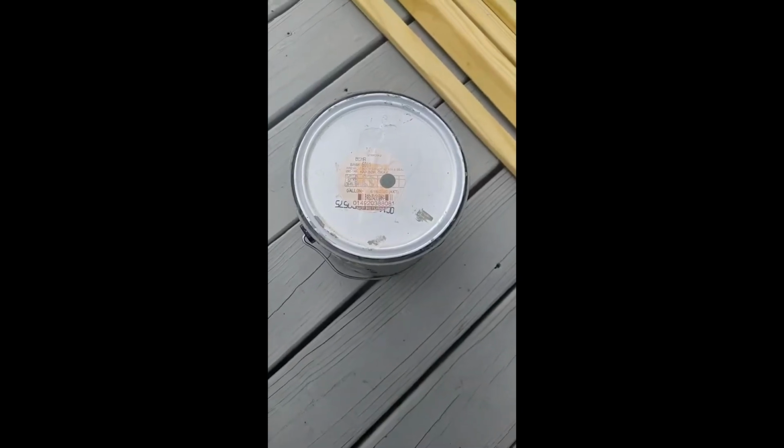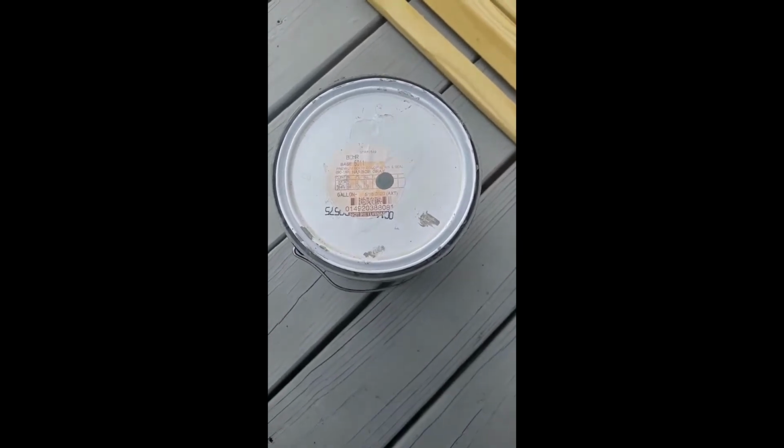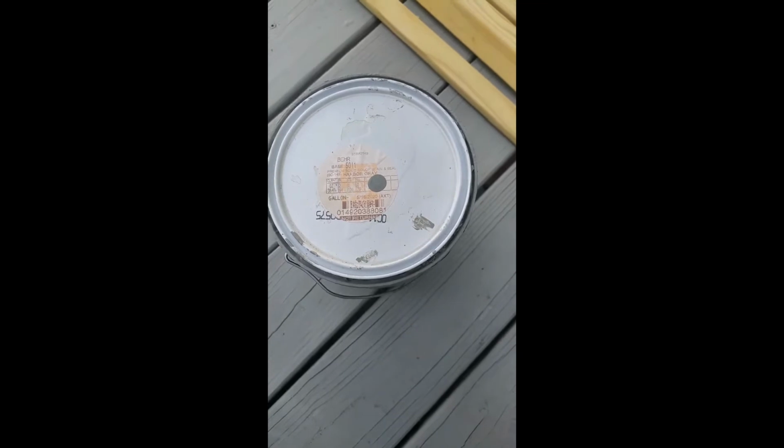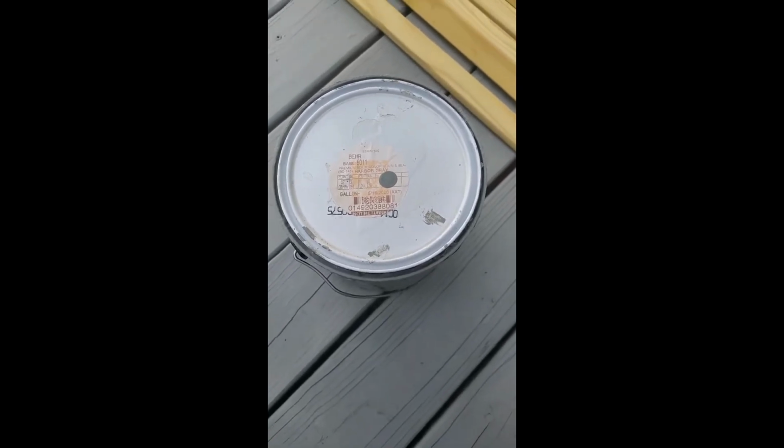For the paint, actually stain, I'm using waterproofing stain and seal from Home Depot. Pick the Harbor Gray color. The next step is to stain the 1x2. You want to do this first before you cut it and secure it to the frame. Otherwise, it will be very messy.